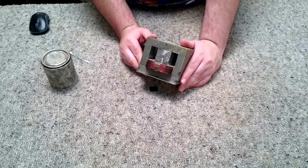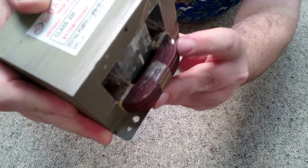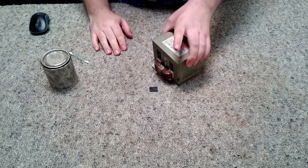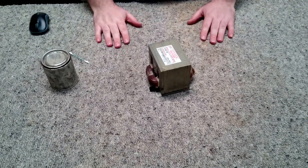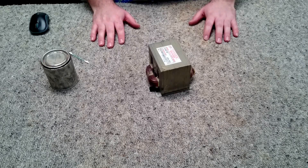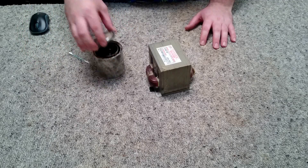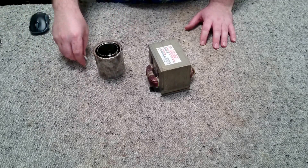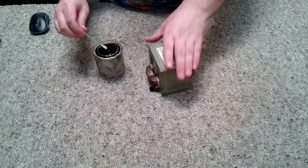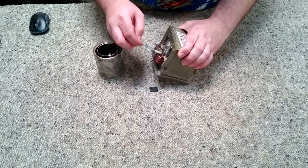Here's the transformer all tidied up. Now despite all my emphasis on not damaging the insulation, I did damage the insulation — but it's okay because I can show you how to repair it. Right now is the best time in the build to inspect the primary for any damage. You can see I've rubbed off the insulation and there's exposed wire underneath. We can use lacquer, varnish, liquid insulation, or similar products to fix it. I've got an old tin of lacquer here — I prefer to use a Q-tip so I can just throw it in the bin when finished. I'm going to dip the Q-tip in the lacquer and brush it on the affected areas.